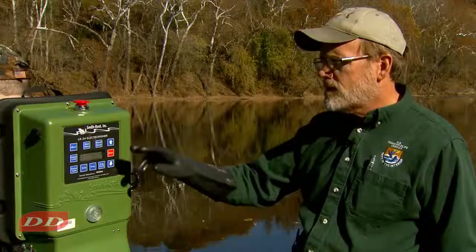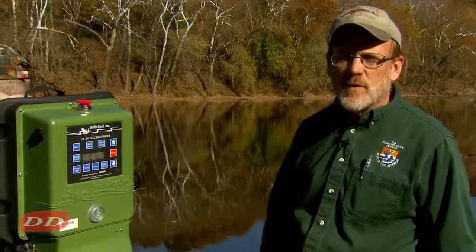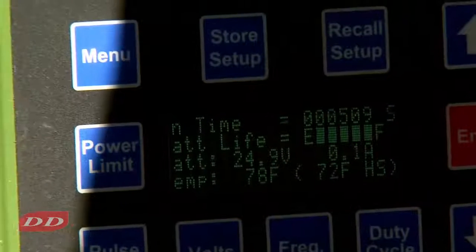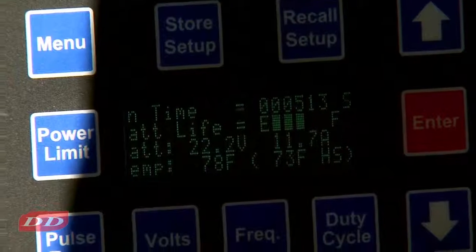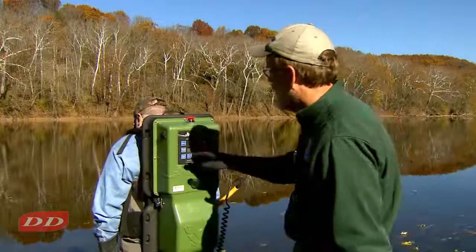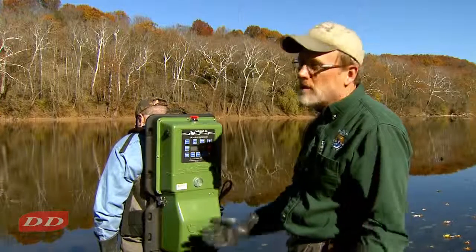We can look at battery output in two ways. Some units have a meter that gives you battery output; other units don't, so you have to use a multimeter. This particular unit does have a meter, and you have to put the battery under load. We have about 24.9 volts. Power up and keep it going - you'll see the battery voltage dropped down to about 22 volts and the battery gauge went down to about three-quarters full. The unit is working and battery capacity is above what it needs to be, so it's not the battery.